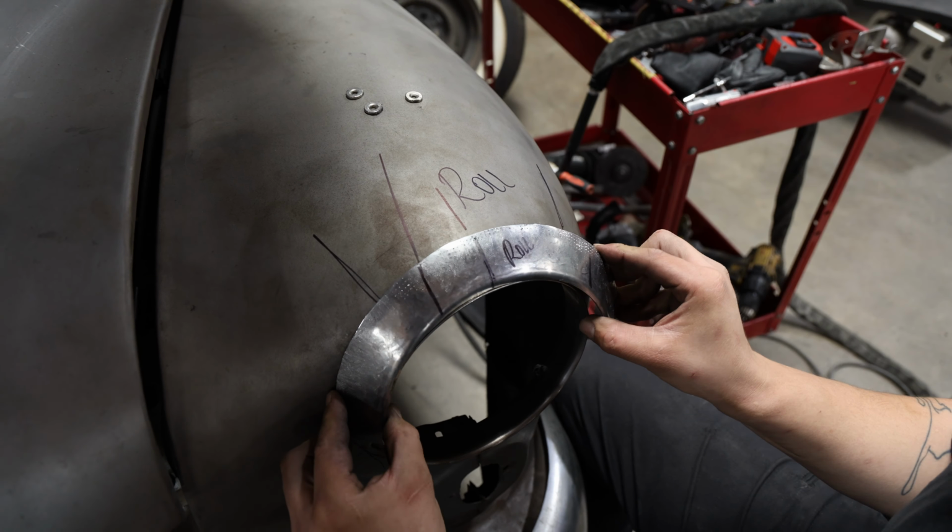The top half he wanted to blend in with the natural curve of the fender, but on the bottom, the new ring butts up against the flat portion of the fender. So on the lower half, he shapes the material so that it blends from the more distinct crown of the top ring down to a more flat shape on the lower half. That 9-inch radius he marked on the fender tells Phil exactly where his material should meet up with the fender.